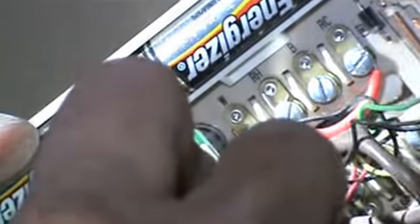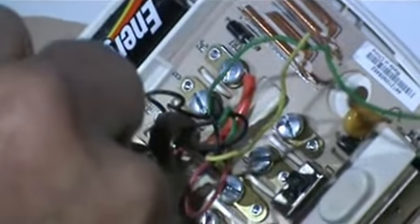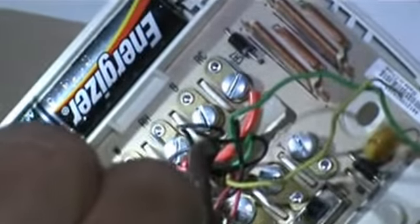There's W, white. See W? But we don't have a white conductor, so it's on black. You see that? All right. Is that automatic? What do you mean, automatic? You say we don't have a white one, so it's on black. Well, we don't have a white conductor. There's no white colored conductor. If there was a white conductor, you would normally have it hooked to W, W for white. But we don't have one, so we chose to use our black conductor on W.